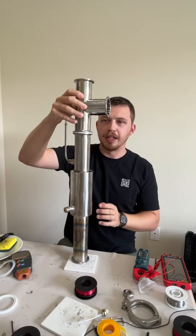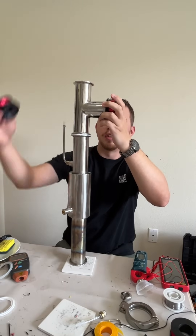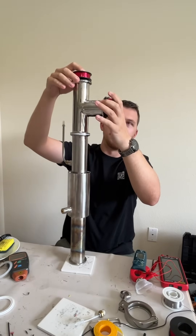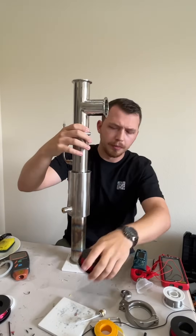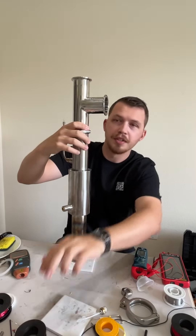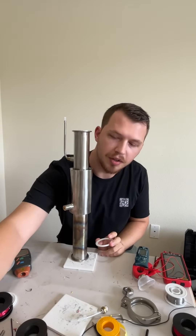For example, this right here would be two linear alternators, so everything just fits with these clamps on top of each other and you can run two at once. That would either be for parallel or in-series if you wanted higher current or higher voltage. But I just wanted to show that concept.